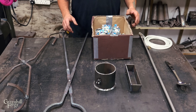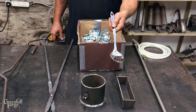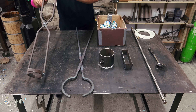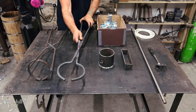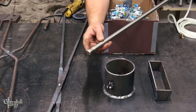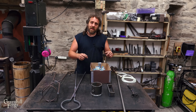With the cubes ready I'll quickly walk through all the other pieces I'll be using during the melt. I made all of these except the slotted spoon, which is solid stainless steel and will be used for skimming dross and slag. I've got two sets of tongs — one set reaches down from the top to pull the crucible out of the kiln, and the other I can set it into for the pour. I've got two molds in the rough shapes of the parts I need. And there's this wand — a stainless steel tube capped at the end with holes drilled out, hooked up to a hose — which I'll get into near the end of the melt.